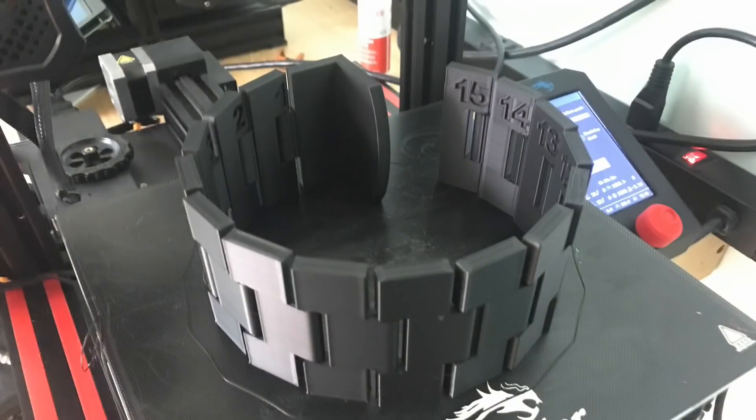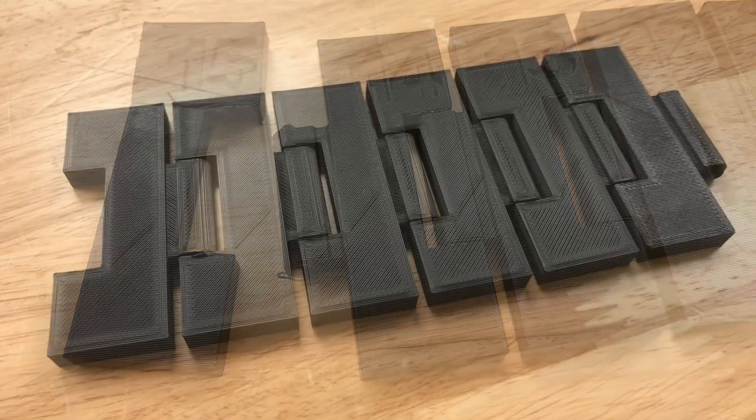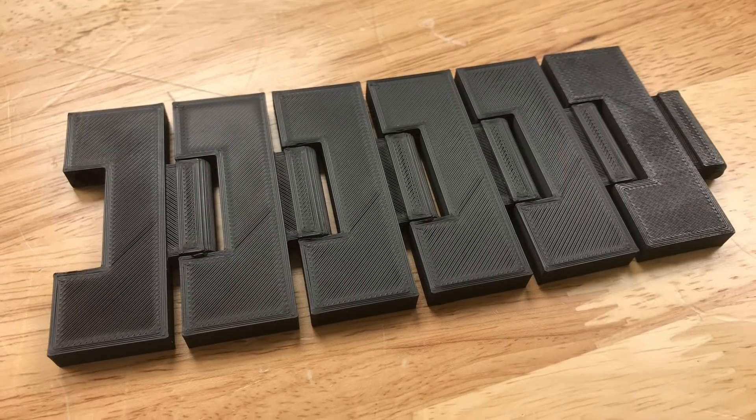Before I got to the snapped hinge I did make one with live hinges, so it was printed and you could take it off the bed and flex it. This way I could fit it on a small bed, but it really didn't work out the way I wanted because printing that way the blocks aren't as strong — the layer lines are such that the way you want to flex it they tend to want to break. That's why I print them flat and then snap them together, and this seemed to work really well. I'm surprised how easy they are to snap together and how hard they are to pull apart.